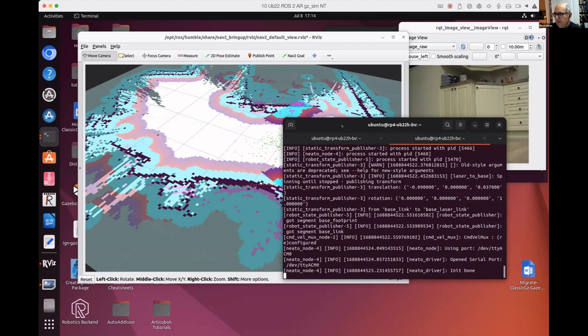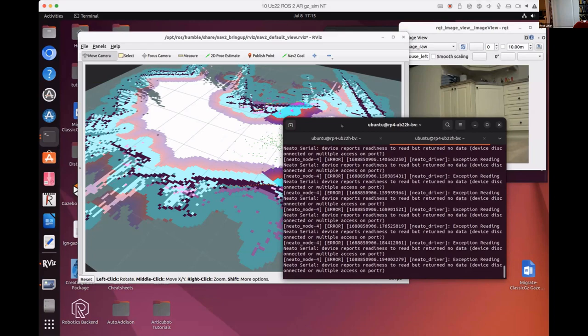No. The debug port on the Neato runs 128 kilobits per second ASCII, and it's directly connected to a USB port on the Raspberry Pi. You need something with a full serial USB interface, which is normally a Raspberry Pi. It's a USB plug, so you need a USB chip, connector and wire. Or wire to an Arduino.